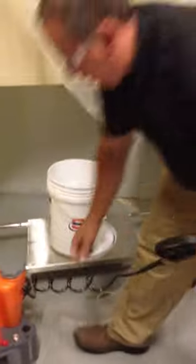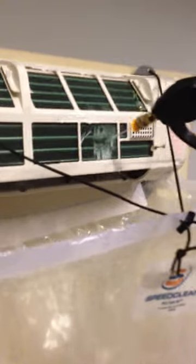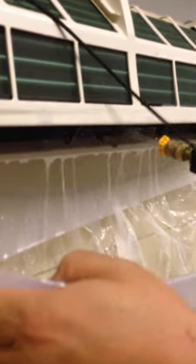We're going to show you with a coil jet. We'll turn the high-pressure water on here. As you can see, all the water that we're using is dripping down into the bib and then eventually down into the bag. You can also use this unit to get underneath and clean the blower wheel of all the mold, dirt, and debris that's accumulated through regular operation.